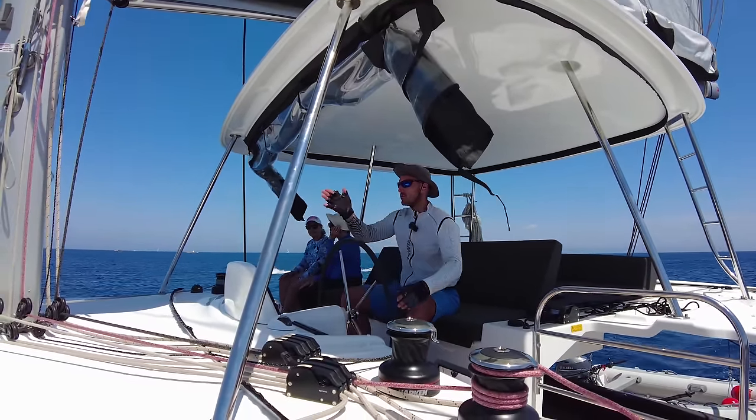So let's think about these two boats. If they're going to turn to the other side, which means the winds would blow from there, now, if the catamaran has a very short chain and the monohull has a very long chain, when you turn, it could happen that they're going to hit, because the monohull has a bigger turning circle and the catamaran has a very small one.